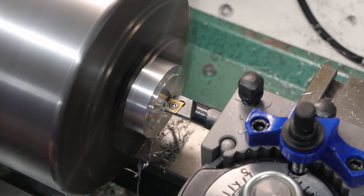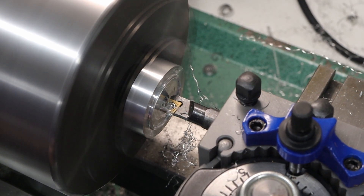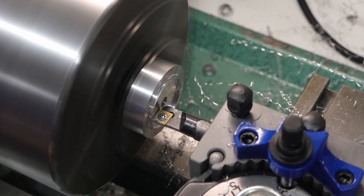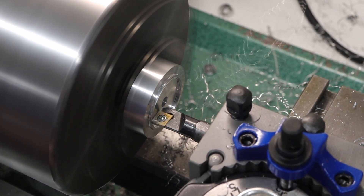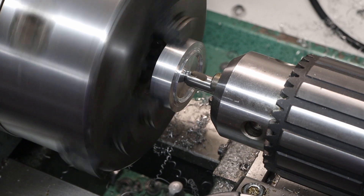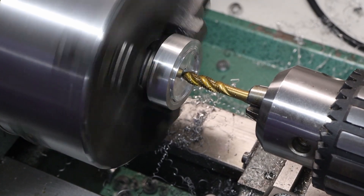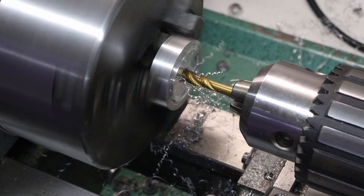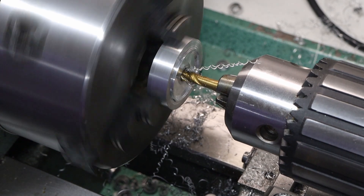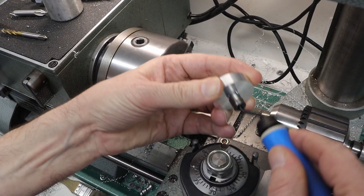The movement will be in place when I am pressing the crystal into position, and that means the rotor on the back is going to be a little bit proud. So I need to make sure that I have clearance for the rotor so that this jig does not hit and damage it. I really love using spiral flute taps — as you can see here, it creates a nice chip that comes out the front, and that means you can power tap it without any issues. Then a quick deburr of the backside, and it's ready to try out.